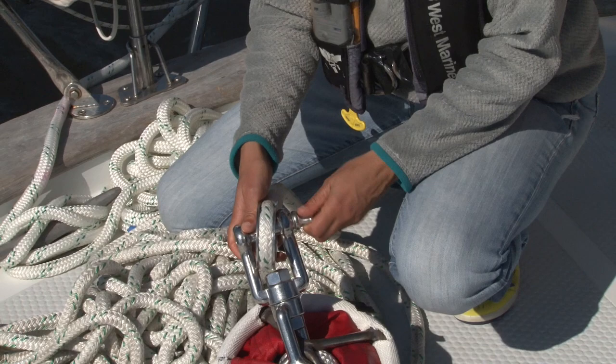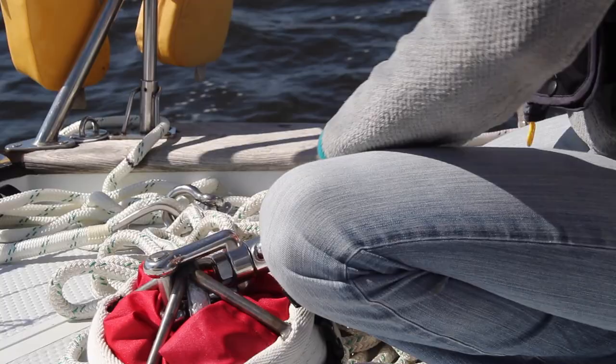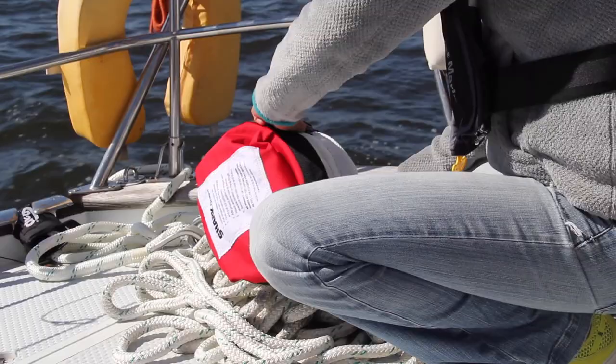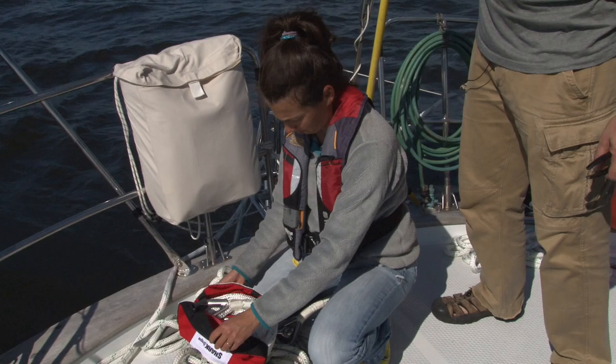And just like the parachute anchors, we would have plastic ties. Yeah, just hand tighten it. That's not going to come loose. And we want to open, and I unclip these. Yeah, you want to open up the shark drogue, and any other speed limiting drogue, we would take them out of their bags, of course. Yeah, you're doing it correctly. Everything's packed inside. Yeah, that's supposed to be there.